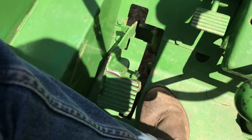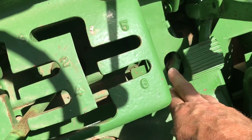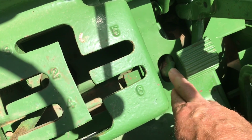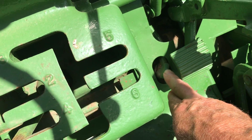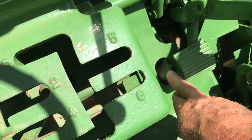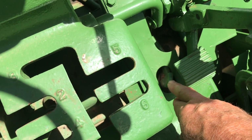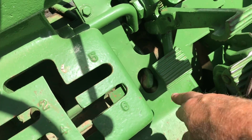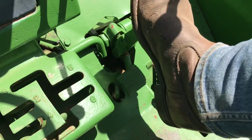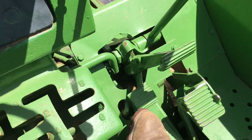We've got two turning brakes, one on either side, obviously. Down here, we've got the lever for turning the power takeoff in gear. You don't normally have the power takeoff engaged at all times so that you can maximise horsepower. So you only turn that to the live position when you need the power takeoff. And here, these pedals are the power takeoff clutch pedals, or clutch brake pedals.